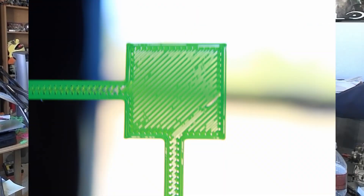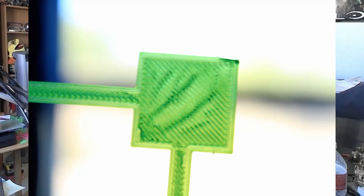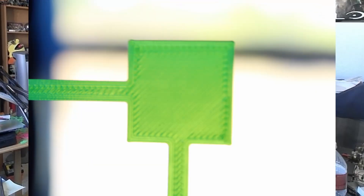To summarize: if you have a thicker shutter blind effect, you have a bigger tall spot that needs to be lowered. If you have a full plastic streak missing, based on the size, you may have a bigger or smaller tall spot. If you have a separation from the outer line and inner skin, it's up to you to either minorly lower the point or see if it happens again. If you have a thin shutter blind effect or no plastic coming out, raise that point a lot, or you may have a different problem. If you have a good bottom but a ribbed top, raise that point by at least 0.02. And you've struck gold if you have a mostly smooth top and a bottom that is seamless or has lines with a good squish. If you need further explanation, there should be timestamps labeling the start of the full explanation for each of these.